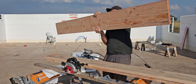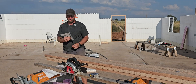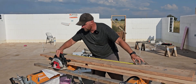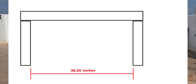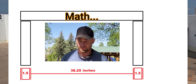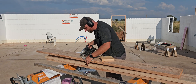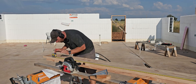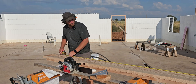Factory purchased boards from big box stores or lumber yards don't often have perfectly square edges. I always cut off about an inch because even my little handsaw with a speed square usually makes a more square edge than you get from the factory. I'm going to make the width 38 and a quarter inches across. However, this piece has to sit on top of the two uprights — each is an inch and a half thick, so together that's three inches — meaning the header length is 41 and a quarter. The height is exactly 82 and an eighth. Check your door manufacturer though, because each one might have different rough opening dimensions.